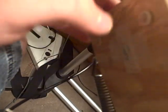The magnet right here and this magnet come close together, and I have the like poles facing each other. So when this comes down, it repels and it closes the contacts. The upper contact touches this lower one, and it's like a short — they're touching, so it conducts electricity, so it's closed. Each time you move this down, it closes the contacts, and it's just like the normal bass pedal. It works the same way.